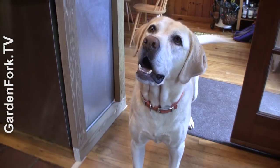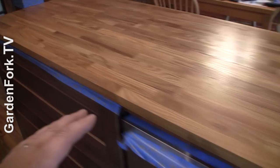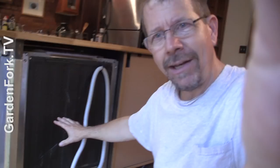Quick update: I've got the dishwasher in and I'm applying another coat of the tung oil, which is why I have the plastic here. I've also got the drain, the electric, and the plumbing — the hot water in, the waste drain out, and the electric — all through a slot I cut in the kitchen floor, which opens to the basement ceiling.